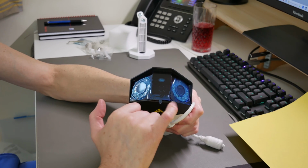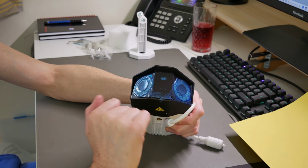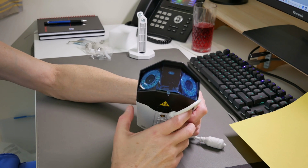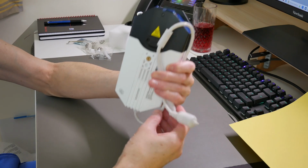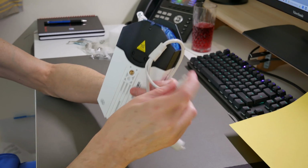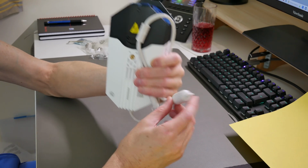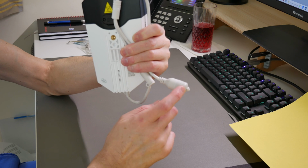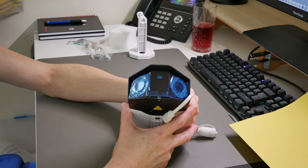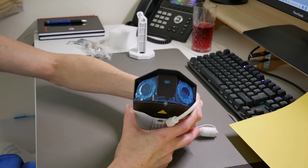And as I've said, the microphone is just in the center here between the two lenses under the plastic film. Obviously you take the plastic film off for the microphone to work properly. The power for this is DC 12 volt 2 amp, if you use the power connector there on the device for the DC power. Obviously this is a PoE camera, so you can power it by PoE, so you just connect it to the RJ45 connector there and it will power it by PoE, should you have the available Reolink NVR, or a switch capable of powering it by PoE.